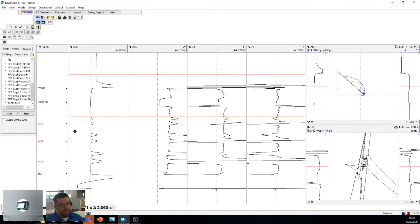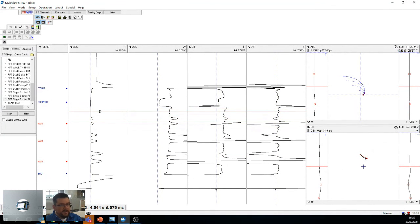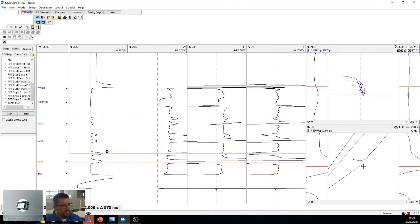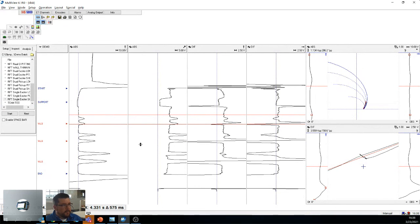short meaning that the defect is shorter than the probe, right? So the defect is less than 2.5 times the OD. What we have here is the exciter and the pickup, right? So you have 2 pickups. One pickup sees it first, and then you see it with the exciter, which is why you have 2 bumps. So it looks like camels, but it's actually 3 different defects of the same length, just different size, depths. And here, what's interesting, this is the RFT curve,